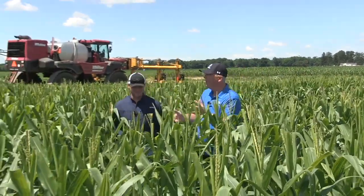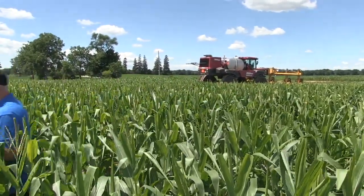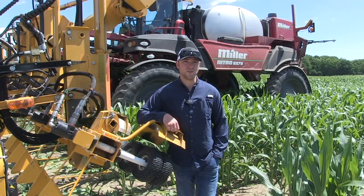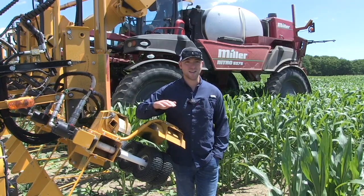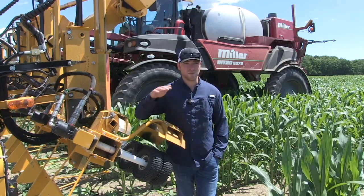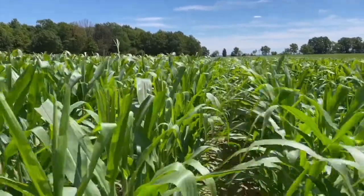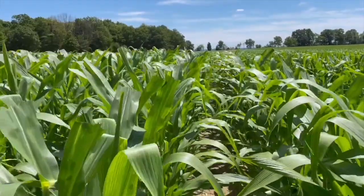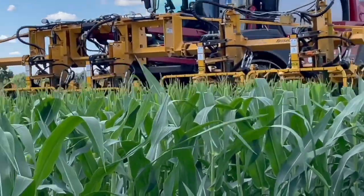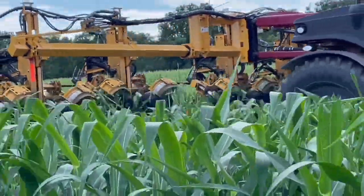It's sort of a two-step process, right? You bring this unit through and you cut the tops of the plants, and then you come back and actually do the pulling. So to start, we come through — it's essentially just a lawn mower deck on the machine — and it comes through and levels the field up. We're looking to cut maybe the most advanced ones in half or a third, and that will give the shorter, less advanced plants time to grow up, hopefully increasing our chances of a good pull. On average it's two days between cutting and pulling, but it depends on the variety and growing conditions. Cool nights might push it to a third day; really warm nights it could be the very next day.